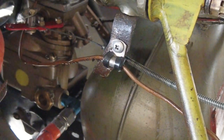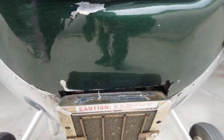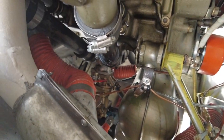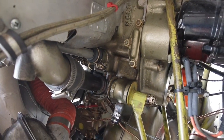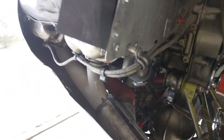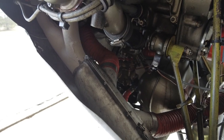Let's take a look at what that carburetor sits behind. Here's the air intake — right behind that is the carburetor. It goes right under the intake spider. So all that cold air comes and hits that throttle body, and that whole area gets cold. Maybe some heat will conduct itself out of the crankcase downwards, but it's unlikely. So how do we warm up the carburetor? We can use carburetor heat — get air run over the exhaust manifold and back towards the carburetor. But if your exhaust is cold, you don't have a lot of hot air going in. So that's a problem.